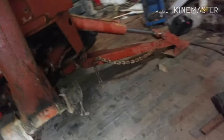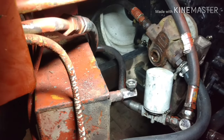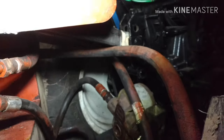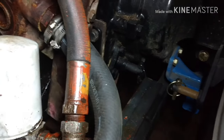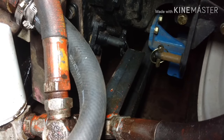I've still got to go through and tidy up this area here. Still got to go through and get shorter hoses. I'm running this unit as a self-contained hydraulic unit on the back. I've got some hoses to replace, and I've got one of these as a Power Beyond — I'm going to cap that off and get rid of one less hose. I've got a stiff mount going from underneath the seat area over to the three-point, with some five-inch channel going back. You can see where it terminates right by that clevis pin, then it goes to two-inch, two-by-two, quarter-inch thick wall square tube, and that runs up to the front.